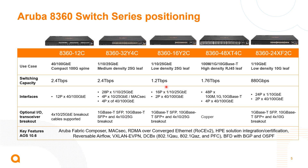There are no port groups on these switches — the only port group is those four MACSEC ports, and that's only on that one switch. The two 25 gig switches and the 10 gig switch also support 1 gig and 10 gig base T optics as well as breakout cables. Breakout cables are supported on all switches except the 48 port copper switch — those 100 gig ports cannot break out. Key features include the Aruba Fabric Composer solution, MACSEC, RoCE V2 and V1, DCB, ECN, VXLAN, and EVPN with BGP or OSPF underlay.